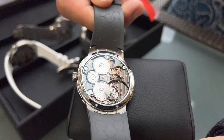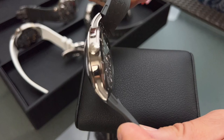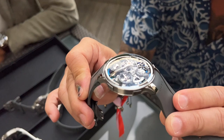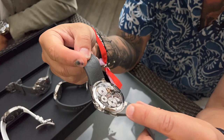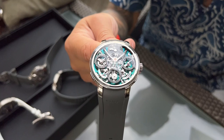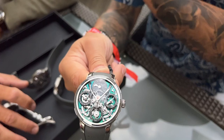That is practically 14 millimeters away — not what you do at watchmaking school. It's forbidden because it's a huge distance. Basically there's a shaft going through the entire movement linking the two. So if you look at the top, that's the hairspring and the balance wheel and this signature balance bridge. Normally that's engaged directly with the escapement. You never have a watch where you have the balance on one side and the escapement on the other side. But that was what was necessary to configure this beautiful array of sub-dials for the LM Perpetual Calendar, which is probably one of the most beautiful Perpetual Calendars ever invented.